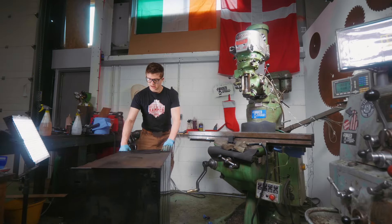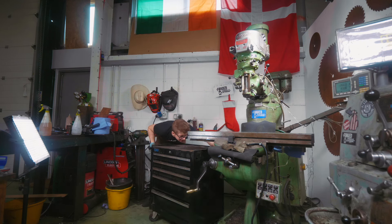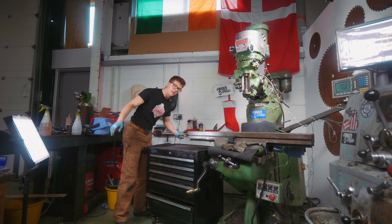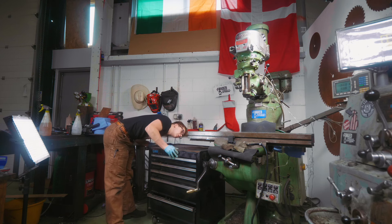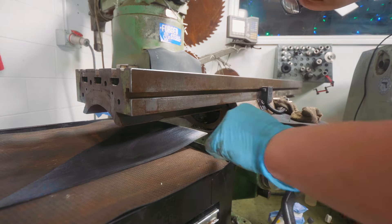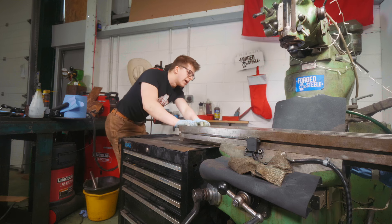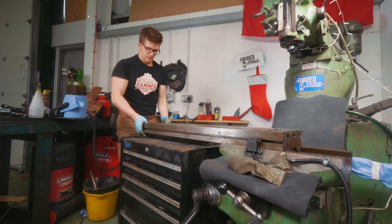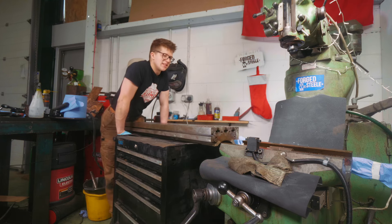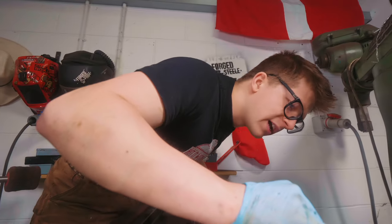After degreasing, it really looks like it's in a lot better condition than the one in the y-axis, which we had to shim by about eight thousandths of an inch — obviously quite a lot. This one is good and tight; we don't have to shim it. So now this table is super loose — I can even lift it up like that, but I shouldn't do that, it'll damage it. I'm going to take one of my tool cards. The things you learn on the internet — there are some amazing forums online. Any question you have about machining, somebody has answered it. This tool card idea is utter genius. I'm going to lower the table until these dovetails are just about level with the tool card, and now we should be able to single-handedly pull this off. Bazinga! Would you look at that? We've got it off of there.